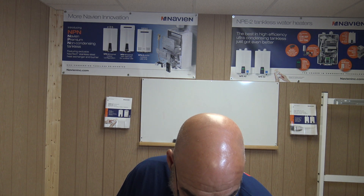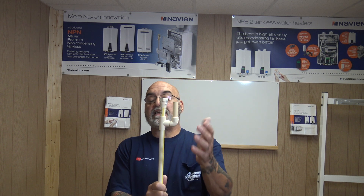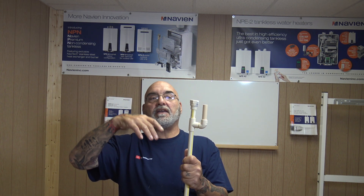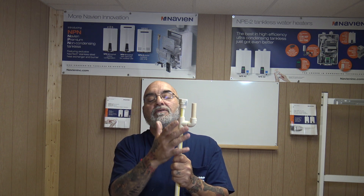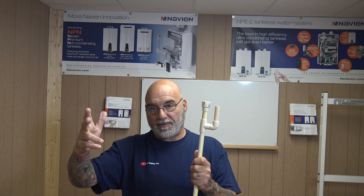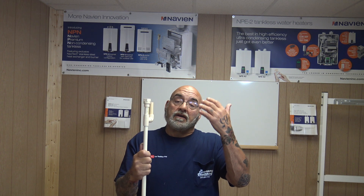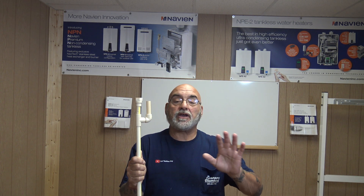On the other videos I've showed you what we do for the piping — the fittings, female plastic. Now I get comments: use PVC, or I've used — no. I use CPVC for the look. You can use PVC if you want to. You don't want to use copper, PEX, black pipe, metal pipe, galvanized pipe — no. Plastic pipe. Why? Condensate is acidic, similar to acid. It's corrosive. It destroys all types of metals and will even erode and discolor concrete. So I use CPVC because I like the look of it. You can use PVC.